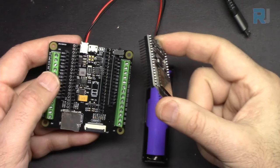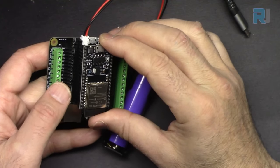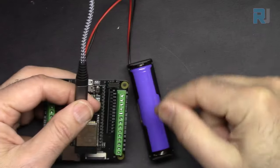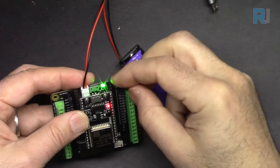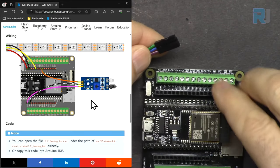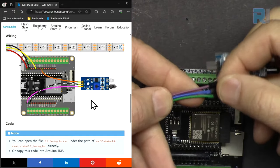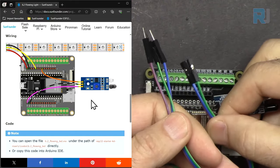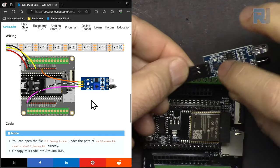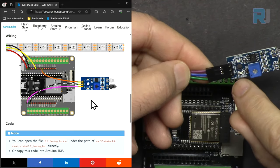When you use ESP32 with SunFounder's ESP32 camera extension module, it comes with a battery and built-in charger so you can charge it and use it with plenty of power. Now for the wiring — first get the infrared obstacle avoidance module with three wires, one side male and the other female. The output pin is the last pin, the middle pin is ground, and the first pin is VCC.